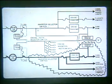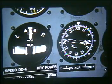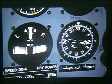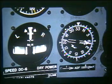AC output to the first officer's flight instruments is almost identical to the captain's, with the exception that the first officer's gyro horizon is powered by 115 volt AC rather than 26 volt AC, thereby eliminating the need for a step-down transformer for that unit. As with the captain, 115 volt AC is taken off to power the flux gate compass gyro, certain radio equipment, and in addition to supply AC power for the autopilot. The turn and bank indicator is 26 volt AC powered through a step-down transformer, with fuses in the AC fuse panel.